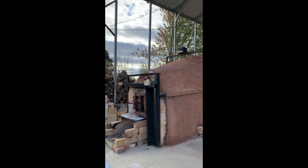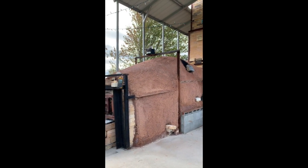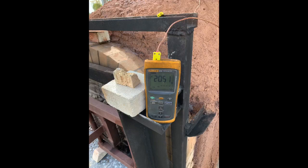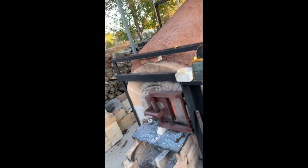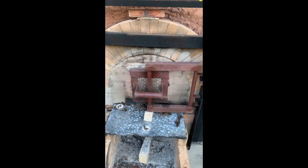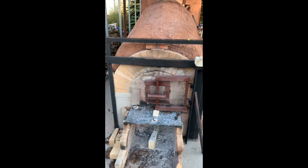Rolling along, 9s are down everywhere in the front, 10s tipping, gonna hold it or try to. And pulling the heat back to the back stoke. Dampered in slightly, good back pressure. Birds are beautiful. During that second day, I had really even front to back. These pyrometers are way off. 10s down virtually everywhere. All right, going into the second night, and it is pretty windy out. Fired off on Tuesday. Taco West first firing, and it will be hard to hold 10 from going all the way down tonight, but that's my goal, is to keep 10 from puddling. It's already tipping all the way down, and 11 is following.